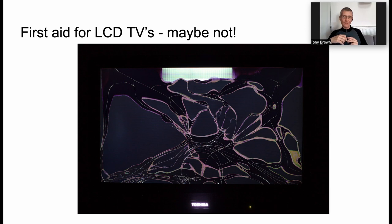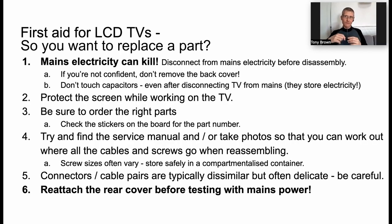So that's why the TV was thrown out. And in this particular case, I think it was the impact damage that destroyed the power supply as well. So I repaired one thing, but couldn't repair the screen. And, therefore, I just took the power supply back out and sold it on. And the TV was recycled. So do check the screen to make sure it's not damaged before you spend any money or try to source those spare parts. Can we move on to the next slide, James? Thanks.